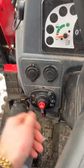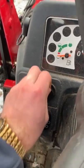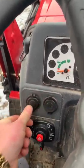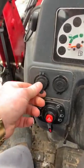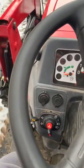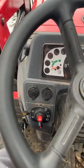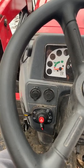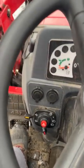Two things I added were a USB charger for your phone — it's a one-amp/two-amp marine-style unit from Amazon that I hardwired in — plus a 12-volt outlet plug. I found it odd that the lower and higher series all seemed to have either a 12-volt or USB plug, but the 1626 didn't, even though Mahindra's website description said it did. I went ahead and added those — there's a perfect spot behind the dashboard to wire it through to the fuse box.